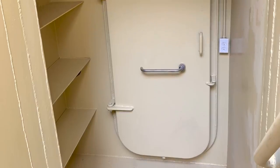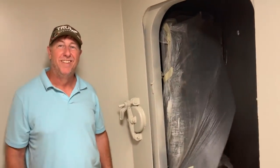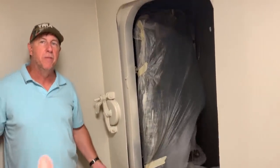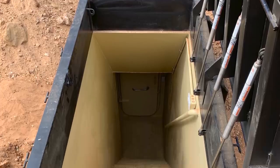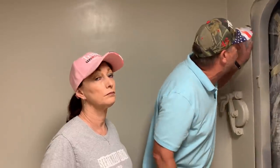These doors weren't really designed to be so much bulletproof as they are gas tight. But they are thicker than the competitors' quarter inch doors, even though they call that bulletproof. I don't even call it bulletproof because they won't stop a high capacity rifle or a high velocity rifle, but they'll stop all the pistol rounds. It'll stop 9mm, 10mm, .22s, all stuff like that. But on the surface, you're going to have the hatch that will stop everything except a 50 cal because it's 3/8 AR-500.